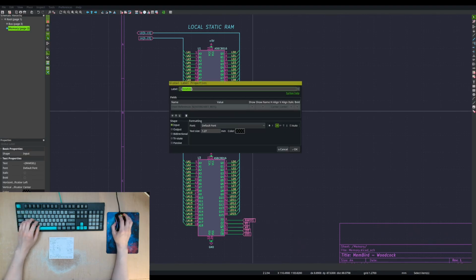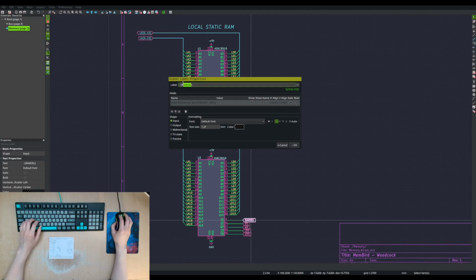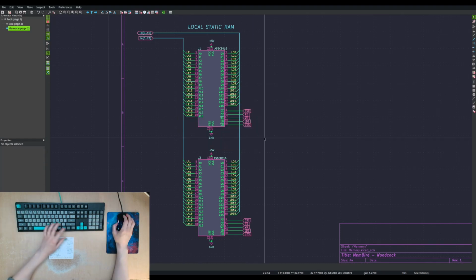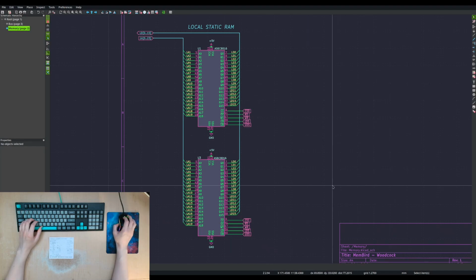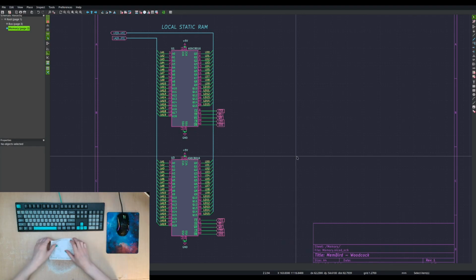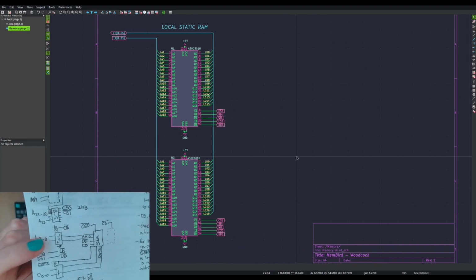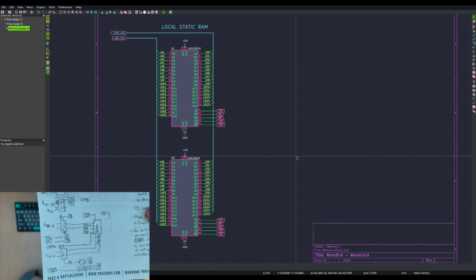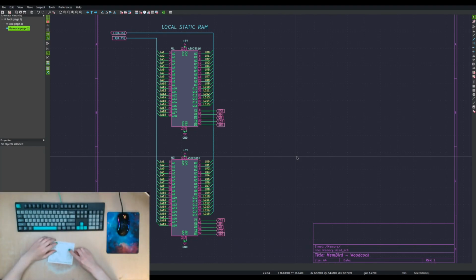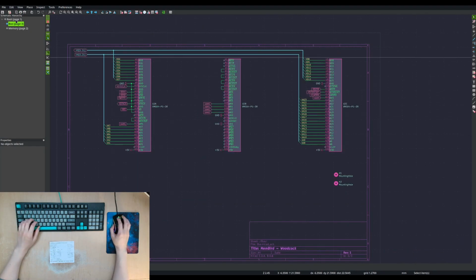And then we've got chip selects. So we'll call these CS0 and CS1. I'm only showing 2 chips at the moment. But the idea would be that we could have more than just 2 chips. How many chips? That's actually a question for this whole decode there. I show it as a 3 to 8 decoder to derive the actual chip to select, but we'll see what we decide to do.